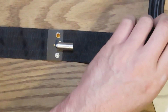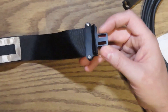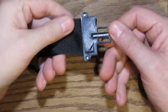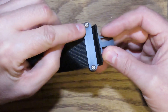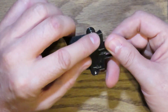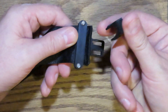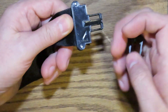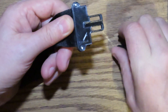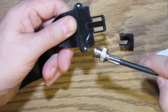So, BNC connector. And now on this end, here's my clamp design in 3D — I did it in FreeCAD, which I'm learning. And here it is in real life. This is the main body of it. And this is the little clamp piece that goes on the back. These are M3 by 8 millimeter screws, but you could find anything in your junk box that fits. These fit real nice and come up flush to the end. This is the clip that clips into these slots to hold your coax. You can see there's a little channel here for the coax, and the clip has a channel here too. This is sized for RG58, which I think is probably the size most people are going to be using.